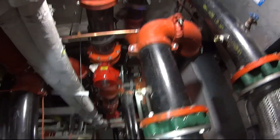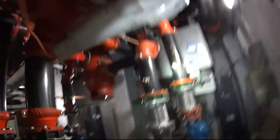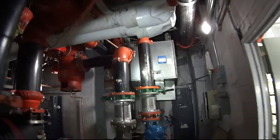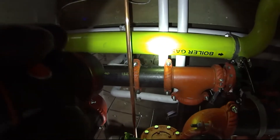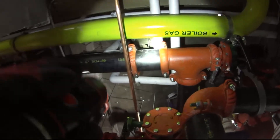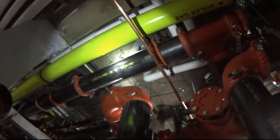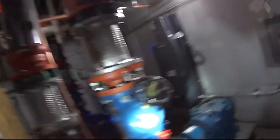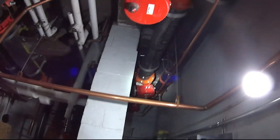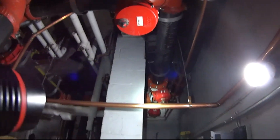I'd say three weeks on this. A lot of the stuff — like that discharge line was at a 45-degree angle. If you notice, this line right here goes this way, comes down, and this one right here — look how much I had to add to straighten out that piece. That's about 10 inches I had to add. That's just insane. A lot of just a big punch list I had to go through. A lot of nonsense — the valve is crooked, I gotta fix that too. Everything just wasn't leveled, a lot of leaks.